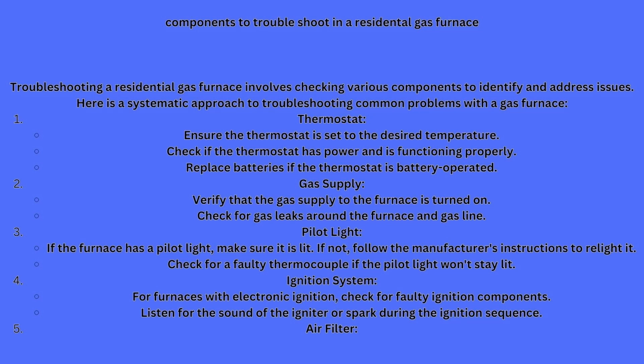And go get you a little squirt bottle, and put some dish soap and water in it and shake it up and squirt across that. Okay. You can find a leak by using it. They also make gas leak stuff that you can purchase from an HVAC store. Home Depot sells it. So does Lowe's. That's physically designed. You can squirt along there to see if you've got any kind of leaks.